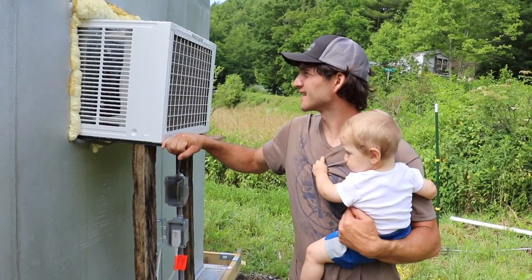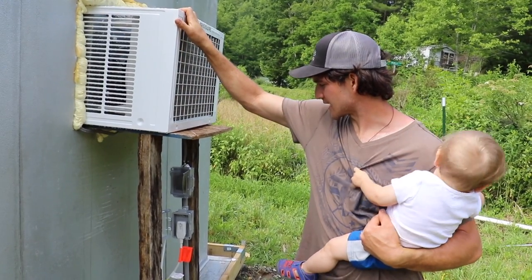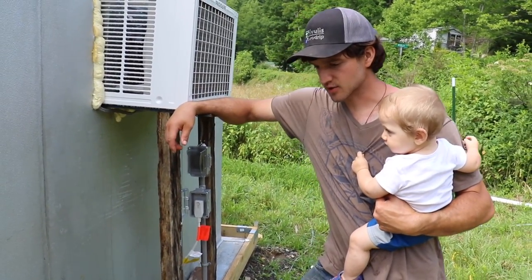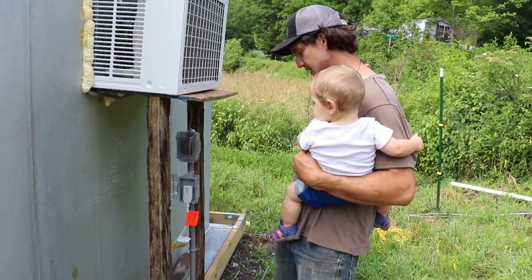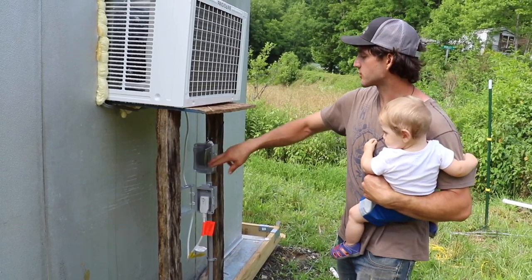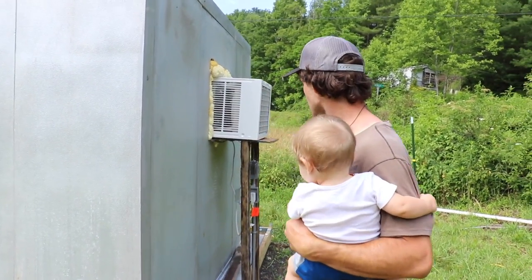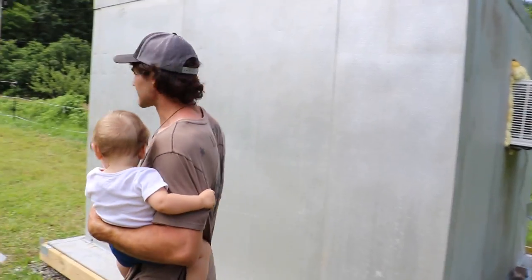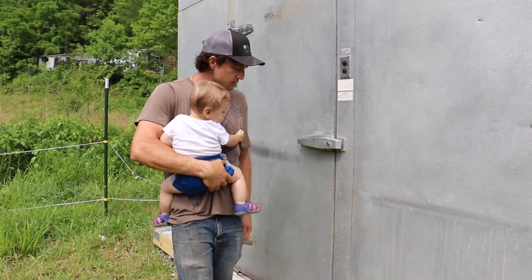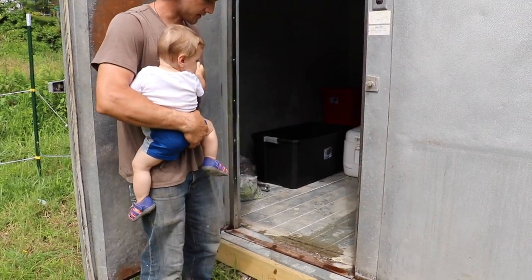The last AC unit we had, we got off Craigslist. It was supposed to be 30,000 BTUs but the compressor didn't work. So I went out and got a brand new one, then found out it's actually 230 volt, which we were not wired up for — so the project got pushed back a couple of days. I had an electrician come out and wire 230 volts into the power line. We've got that, and then 125 volts up here to power the CoolBot itself. We stuck it in on a slight decline so the water runs back, and spray-foamed the outside. It's not the neatest, but it works. Thanks to Steve up in Madison, Wisconsin and David up in Rocky Top for the panels — we basically just framed it in with two-by-sixes.